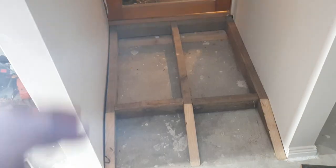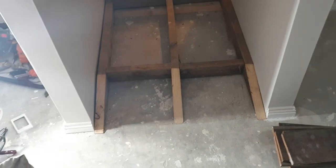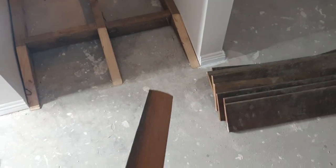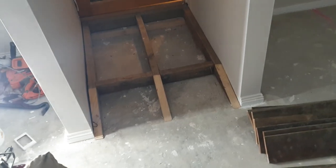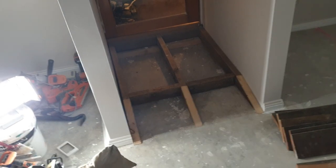We'll put steel brackets on the back of that, and screw in with some really nice big Ramset screws through the sides, then come down. We've had to chamfer and basically make this piece. This is the bit that's been planned down to suit. Once our carpet and underlay comes in, the carpet guys won't like this — they'll bitch about it for sure — but everybody has to have their problems in life and that will be one of theirs.